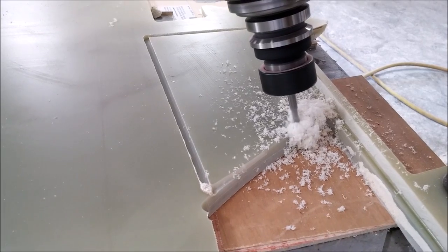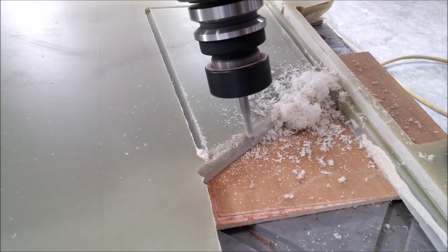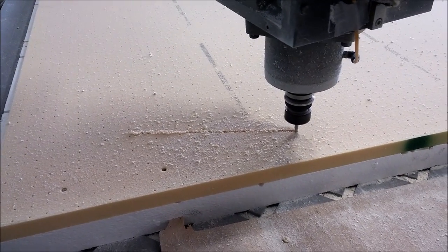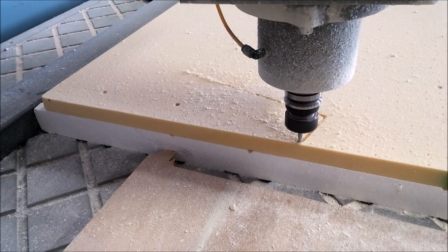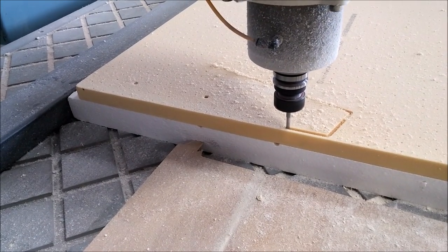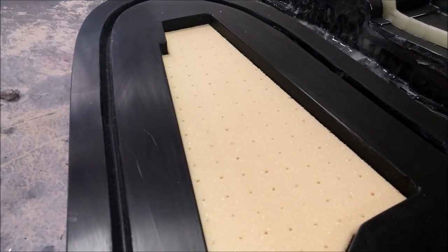Here's the last piece getting cut — this one is half-inch thick, being cut with four different passes at one-eighth inch per pass, using the acrylic mill bit we used when cutting that fiberglass. Meanwhile, here's some high-density foam being cut for the small brace that mates between the rear pressure bulkhead and the aft bulkhead. It goes through fairly easily compared to the FR4, which is much harder to cut.